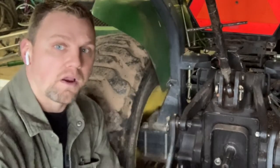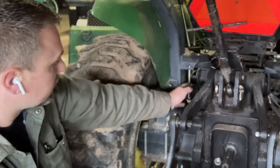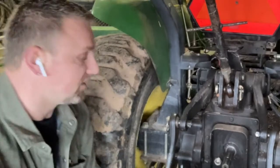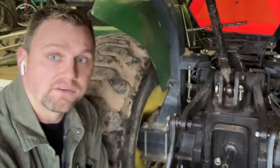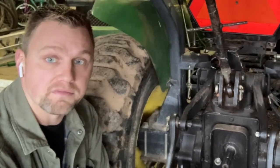In this case, this specific wire is actually wired up for more lights. When we want to run more lights here, all I've got to do is drop a wire down the inside of my roll bar, and it comes right out of that same spot. I splice it into that, and I now have working lights up on top of the tractor — no need to tap into the wiring harness or the fuse box. It's already done from the factory.